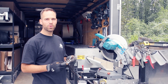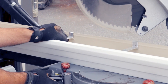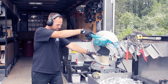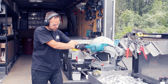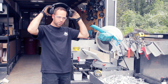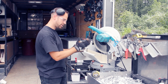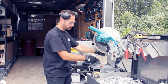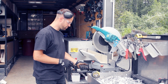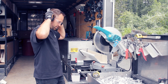Next we want to show you how to do an inside corner. First, turn your saw to a 45 degree angle and run it out to the right position. It's important on the inside corner to cut your back straight, because sometimes when you do your cut the material wanders around a little bit, making a slightly crooked cut on the back. So what you do is go straight and then just do a little skim on the back side of the gutter.